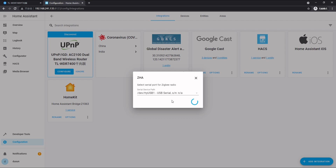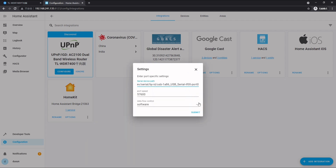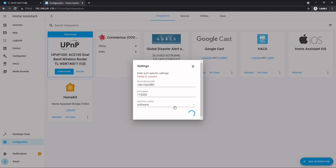It might take a while. Next we enter our radio type — we choose the first one and click Submit. Onto the next step, we want to change the serial device path to the same as the previous one: /dev/ttyUSB1, the same as we input on the first step. Here we also choose ttyUSB1 USB serial, and we change the port to 115200, then click Submit.